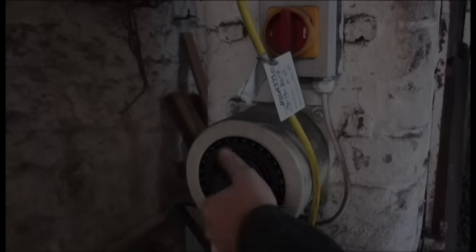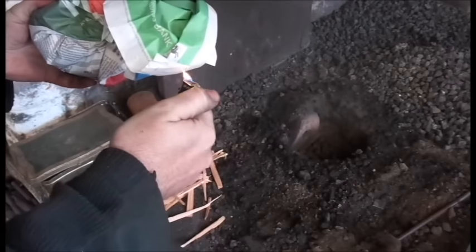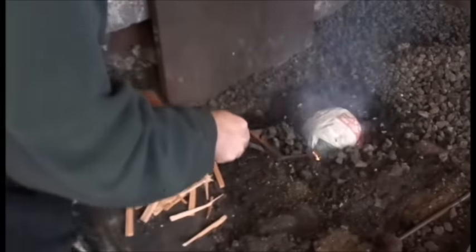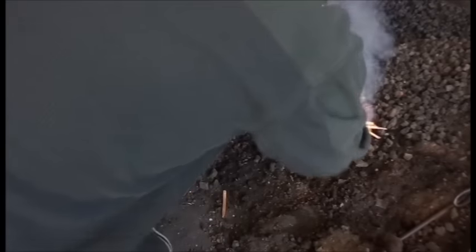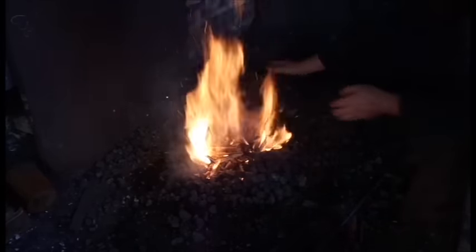When lighting the fire, I first get some air going so that the newspaper doesn't suffocate. When the paper is in, I seal around it with coke. This stops the sticks from falling down the side of the paper where they won't burn, and also directs air straight onto the paper. I pile the sticks straight onto the newspaper, and the reason I like short sticks is so that they follow the newspaper down as it collapses through burning. I seal the sticks in with coke also, just to keep the air blowing on them, otherwise it would just blast out of the sides.